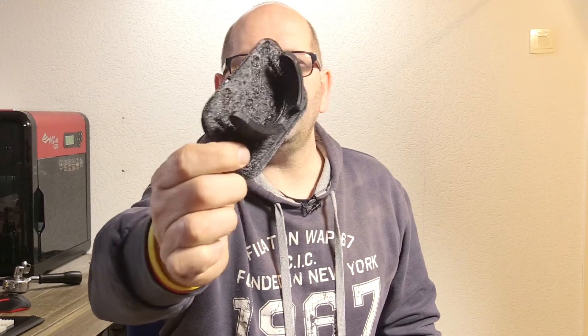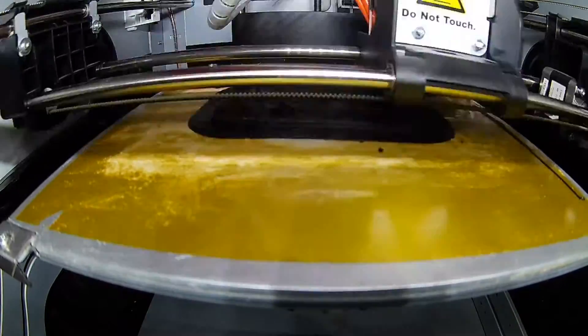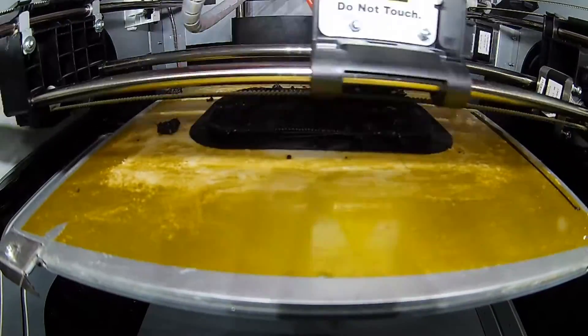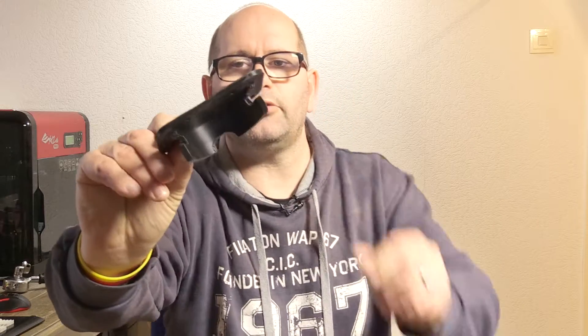I printed it at midnight, so I was in bed, and the next morning when I woke up I saw this laying around — and as you can see it's all brittle and not very nice. Something strange happened. I found out because I made a time-lapse movie of it and I could see it shifts a little on the print bed, so it came loose from the glue. Because of that I made a new one, and this one came out perfect.